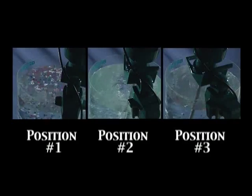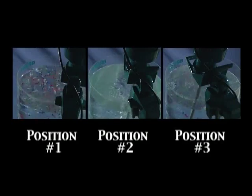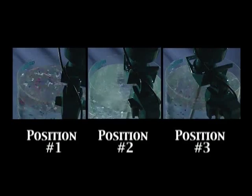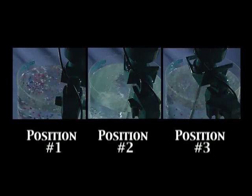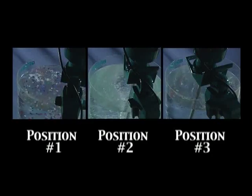What we have seen and learned from this demonstration is that the appearance of good mixing cannot be judged from surface action. In fact, less surface motion in these examples equals more mixing. Thank you.